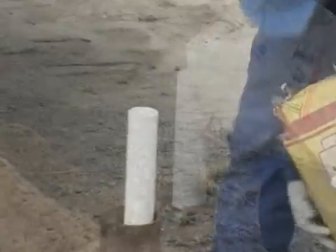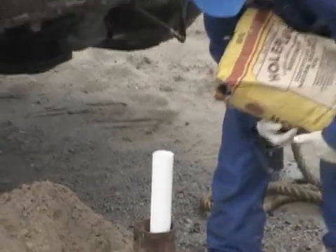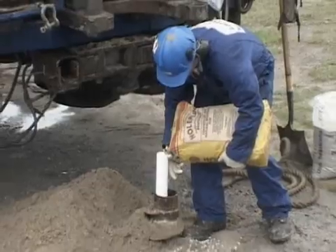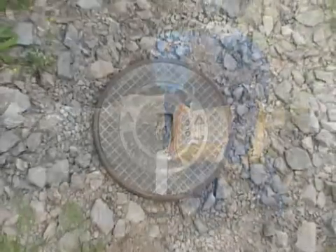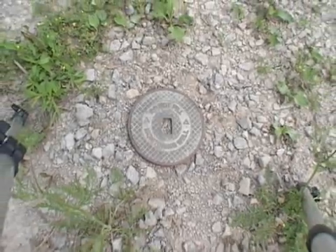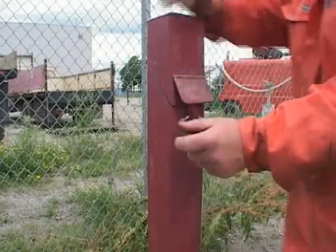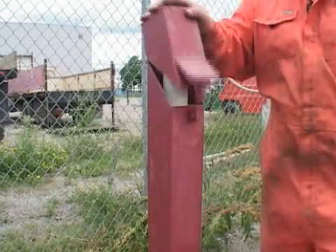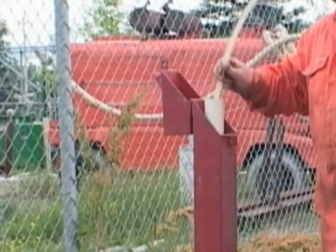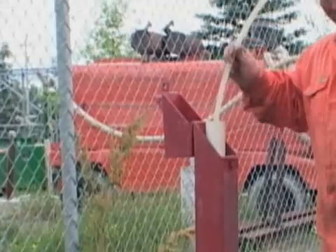The remainder of the annular space is now grouted as the auger sections are tripped out. Monitoring wells can be completed either using a flush mount cover or with an above-ground protective casing. Both finishing techniques facilitate ongoing water sampling.